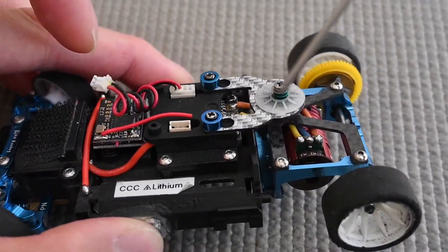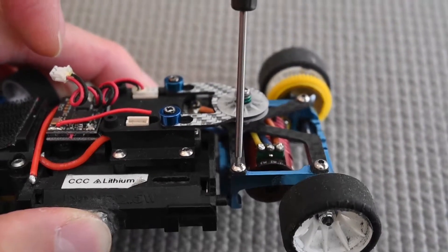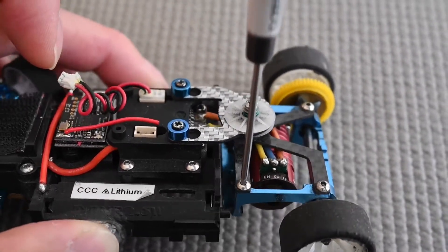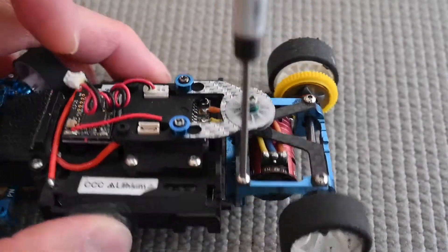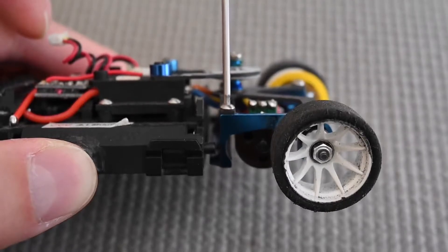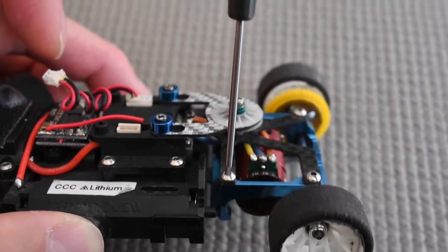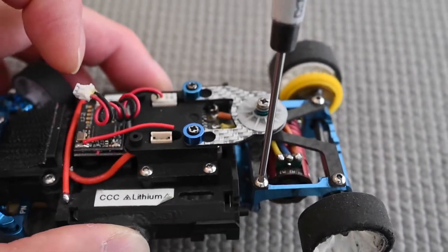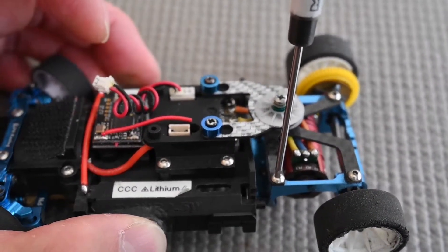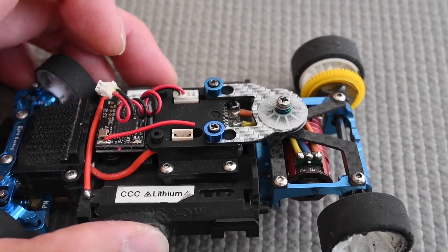The other type of screw head is a hex head. These are generally much easier to deal with. There's no taper in the socket head so you don't really need to push down as hard to get good torque — you just need to turn. As you upgrade screws you generally want to go more towards the hex socket heads instead of the Phillips heads.